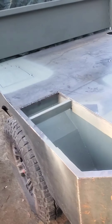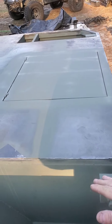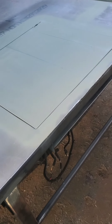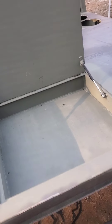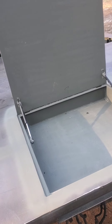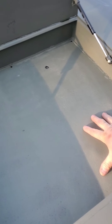It's the end of Thursday and I got a lot done in the last two days. I got the deck down — it is welded down. I got both pieces down, got the seam all the way across in the middle. I got this box built. I don't have my latches yet so it doesn't have handles, but it does have shocks on it to hold the lid up. Each shock is supposed to be 18 pounds, but that's 3/16" plate and it's about four square feet of it.